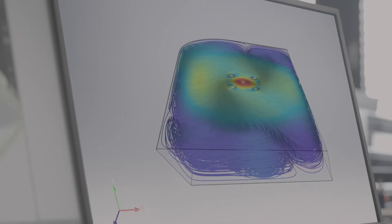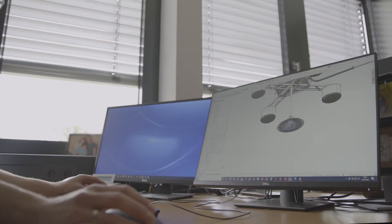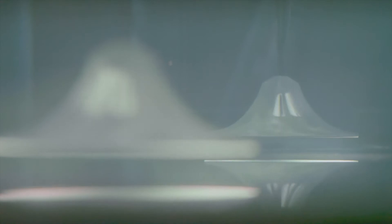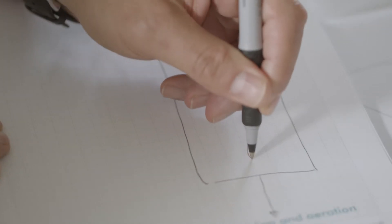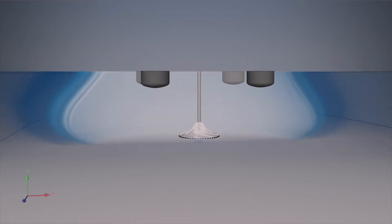For existing lagoons, we can revitalize the unmixed and unused portion of a lagoon so all dead zones are reactivated. Concurrently, this design thoroughly homogenizes and aerates large areas and volumes. The fluid mechanically optimized design of the EVO7 mixer body can avoid flow short-circuiting, guaranteeing long and consistent retention times for the influent in the lagoon.